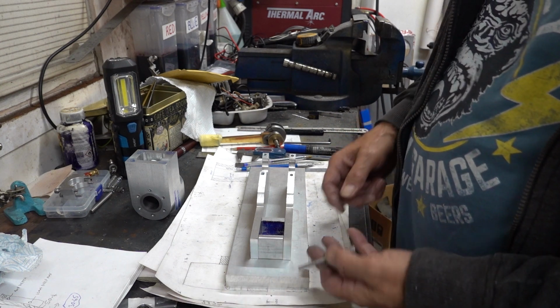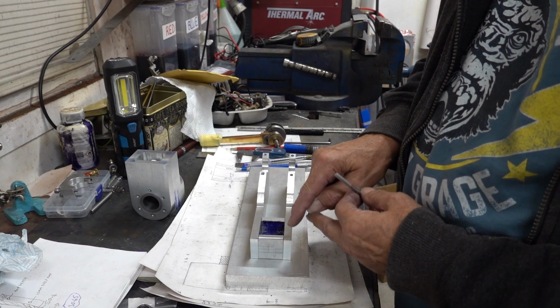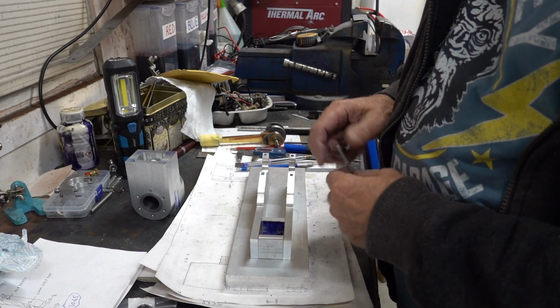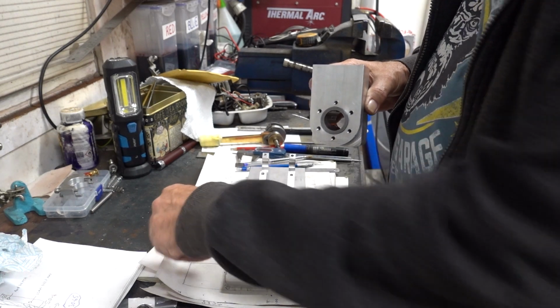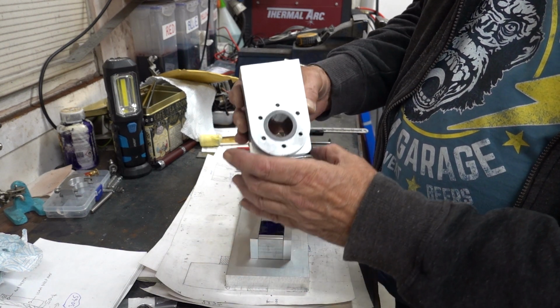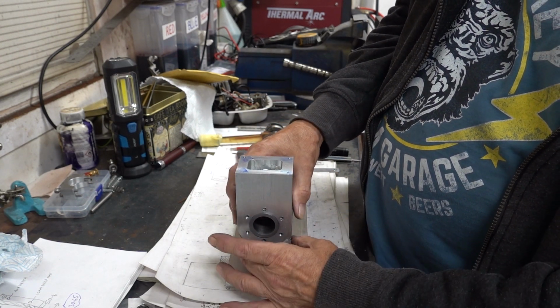So I'm going to drill and counterbore from the underneath of this base all the way through the cheeks, including those two pads I've just made, up through and into the bottom of that. So that, you can see now, we've created that little monocoque. I can do this without knocking everything over. That sits there like that.